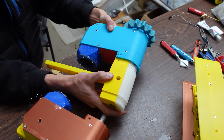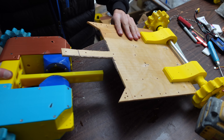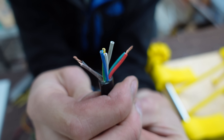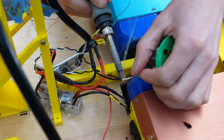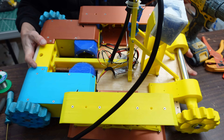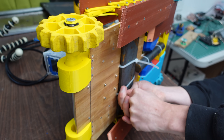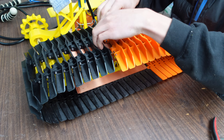Next it was time to start reassembling the vehicle. The two gearboxes attached to this center brace and screwed on, and then the whole drivetrain assembly gets attached to the plank of wood. Here's soldering the ESC power wires with silicone under the heat shrink. The big tether wire I'm using gives power from the motor two strands, and the ESC PWM signal wires and the video signal get one strand each. These are the mid-track support skids going on. All these 3D printed components are probably pretty buoyant, so to sink the whole vehicle I attached some chunks of steel to the bottom — those got glued on and zip tied in place. Next I installed the injection molded tracks.